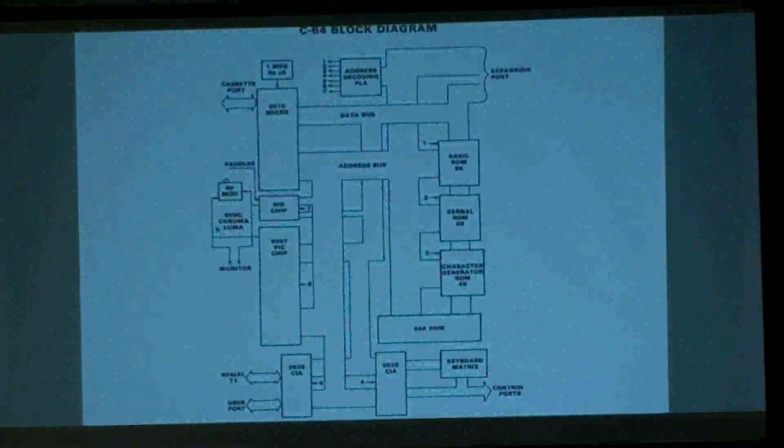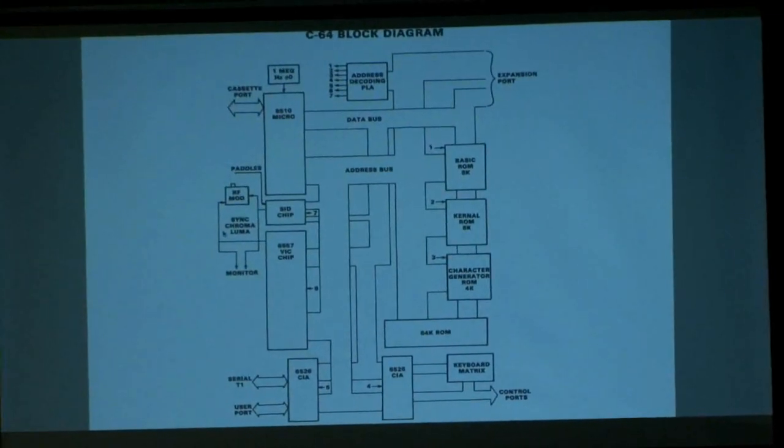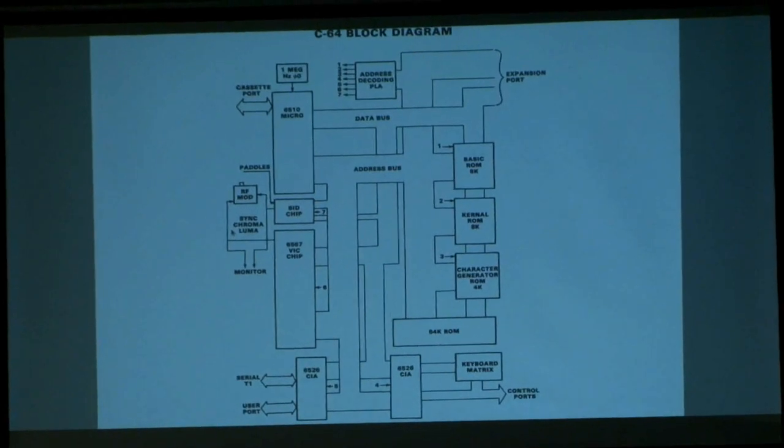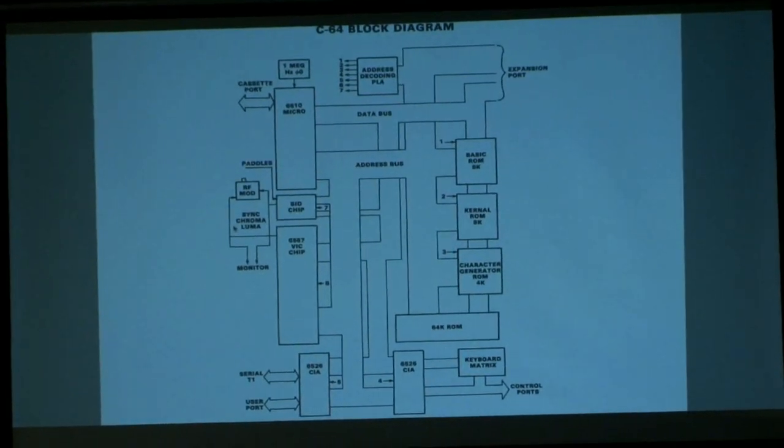So we did not put a 6502 in the Commodore 64. It's a 6510, excuse me. And so one of the big changes was you could say, okay, 6502, you don't get to play with the address. Tri-state your address for us, so you could actually do the DMA and all the rest of it. And it sounds like you could also tell it, wait, don't do another cycle. Yes. And so forth.